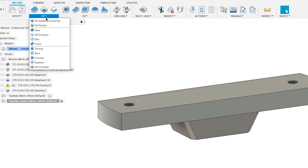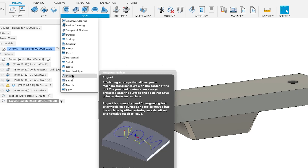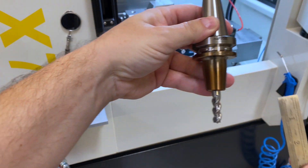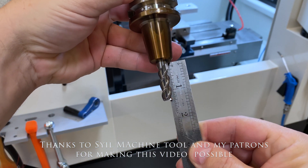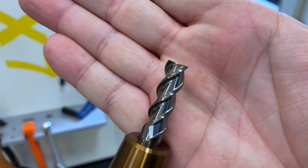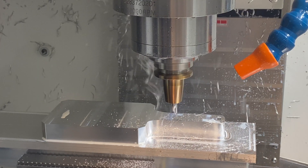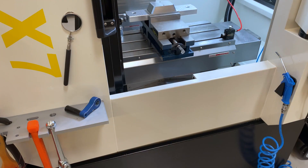Welcome back. We're doing a little 2D adaptive right here. There are lots of different tool paths and lots of different cutter styles, and I want to cover a little bit of that in this video. This is a YG three-flute end mill that we use for a lot of our 2D adaptives and 3D adaptives. You use the edge of this end mill — generally speaking, more often than not, we focus on cutting with only the edge, very deep cut with a very low radial engagement. That would be considered high efficiency milling.